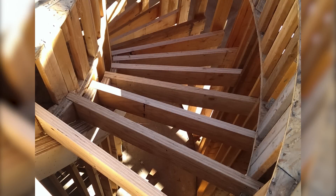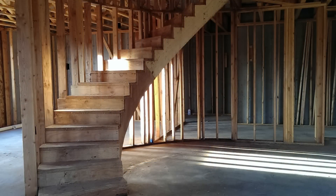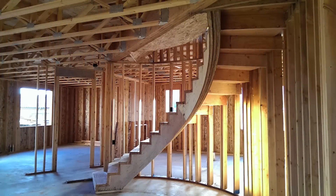From here it was all downhill. My brother and I cut risers and treads from 1-and-7/8 LVLs, then using more Titebond original and Simpson SD screws, screwed them all together — from risers to treads from beneath, from treads to risers from above, and both treads and risers to the stringer — and it was solid.